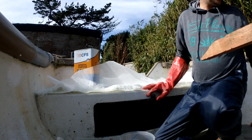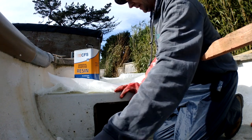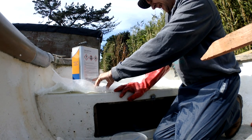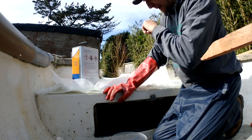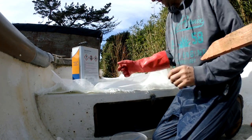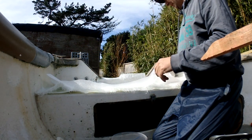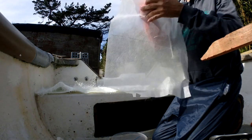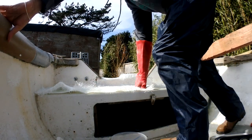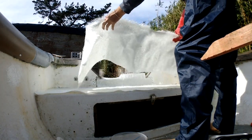So we've got our tub for mixing - this is about one and a half litres I think. The mixture ratio - I think it's five to seven - but I don't want it going off fast. If it goes off too quick and you're half finished, you're in trouble because it will suddenly go into a gel and then go hard. It can take longer if need be - the thing is, it will set eventually even if you only put a little bit of catalyst in. Putting too much - not good. And not only that, it gets hot - it can get very hot if you put way too much in.